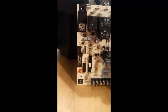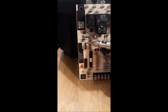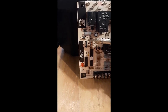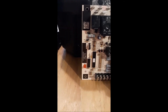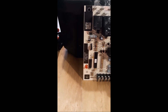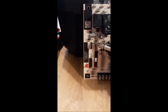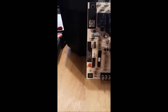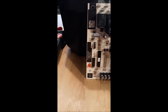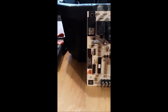Last but not least, over here you have a set of dip switches — it looks a bit like your defrost board with 90, 120, 150, 180 settings — but here we're not dealing with defrost. What we're setting is how long the blower stays on after a call for heat ends. You can set a blower time delay from about a minute and a half up to three minutes, allowing the blower to run and cool down the heat exchanger and push all that residual heat out.